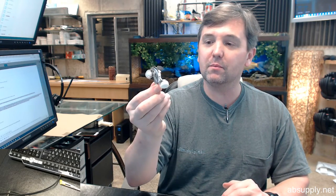Another scenario to consider would be a residential application where you have a restroom, and you've got a small door, let's say with opaque glass installed, and the door can open and practically hit the commode. You don't know that you want to rely on a piece of hardware like this to do that job. So use it where it's appropriate. Use it where there's not going to be abuse or the potential to overextend, because what you can end up doing is damaging the door, the face of the door, damaging the casing on the frame, and certainly destroying the hardware and damaging whatever the door is making contact with. So they have their place, but they're not the perfect solution to really stop a door. Use them when they are best suited, those applications where you don't expect damage to occur, and you just literally want to have the door gently stop where it's supposed to stop, and this piece of hardware will work out splendidly for you.